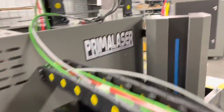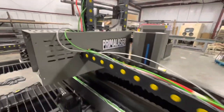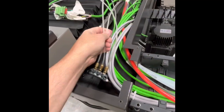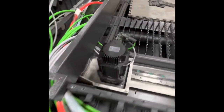Still connecting everything up now that the gantry is installed — making all the connections. That's the Z lift motor there, three wires that get connected in the head of the gantry. Here's the oil line configuration; some of these just get cut at the factory so you have to make up new ends and get those remounted. The machine runs on linear motion bearings that are all lubricated. Some of the tubing and wiring goes inside the gantry casting itself, and some runs along the cable trough.